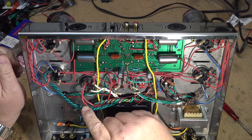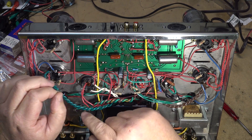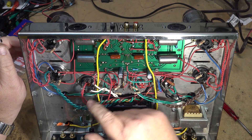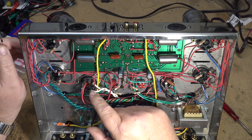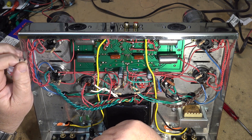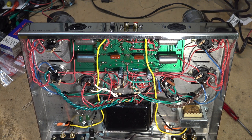The rectifier is still going to operate as a rectifier, but it's going to have a solid state rectifier ahead of it. That's going to eliminate the negative-going swing. Typically the plate is positive, so it cancels off the negative portion of the waveform. The negative waveform would never make it through the tube anyway — the tube only conducts when the plate is positive, pulling electrons from the cathode towards the plate. The two diodes eliminate the back half of the waveform so it never makes it to the tube, because it appears the reverse polarity is so high that it causes the tubes to arc over internally.